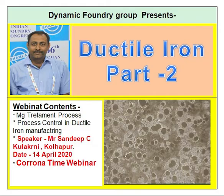The time between magnesium alloy addition and tapping. This is what happens many times. We take the bath sample, and once we take the bath sample, the pouring operator suddenly puts the magnesium inside the ladle, and then we come to know that there is some issue in the chemistry. Either carbon is high, carbon is low, or manganese is high. We have to rearrange that chemistry, and it will take some 5 minutes. Till that time, whatever magnesium is put in the ladle will start burning. So the time between magnesium alloy addition and tapping should be minimum. It should not be more than 30 or 45 seconds.